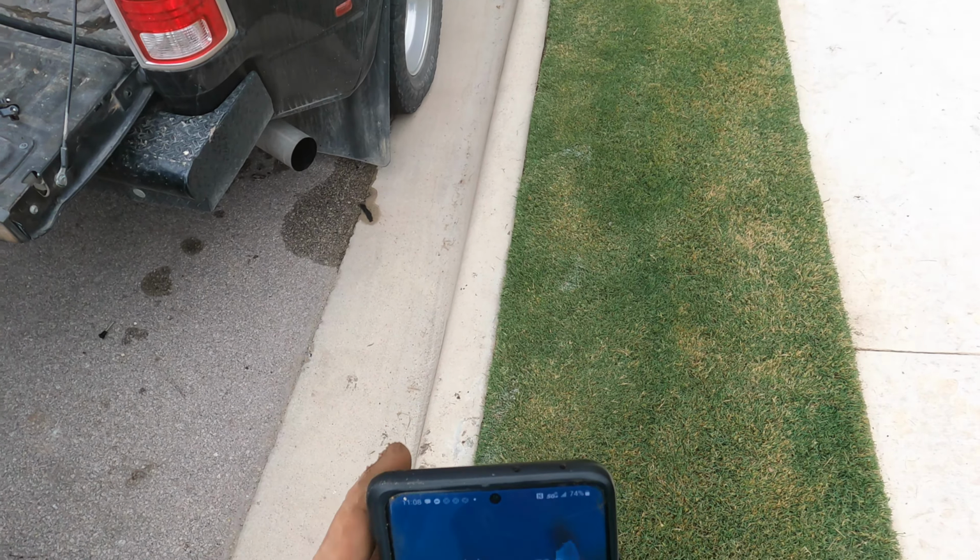Yeah, got everything covered up. This one's gonna be iffy. We may have to tear this out. Let's look at it. Oh, the rain's slowing down. See those speckles all over it? The question is if we can trowel that out. We did not get plastic on this fast enough. We're good on that side, but this is the one where I don't think we got it on fast enough. We're gonna see. I already got the joints rolled on it. We should have just covered it up right when we saw the storm clouds brewing.